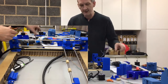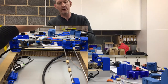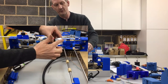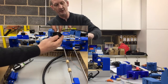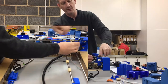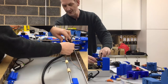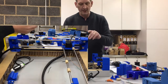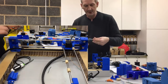Using my X motor — on this I've got the 22-tooth GT2 pulley wheel already set on, and I've made sure that it is set level. The way I've got this is to make sure that when it goes into position it's in line. I'm going to have the wiring pointing upwards so when it's flipped the right way around it's actually downwards. Just slot that into place. At this point I'm going to need four 16mm M3 bolts to put that into position.